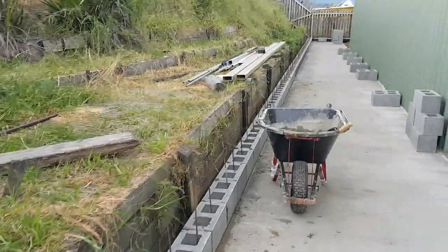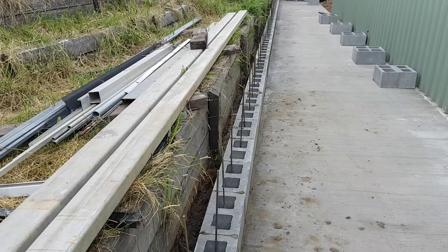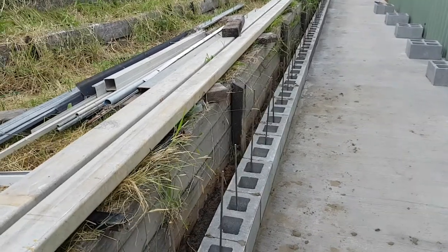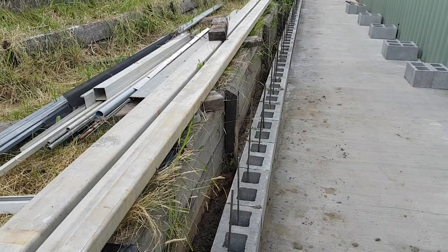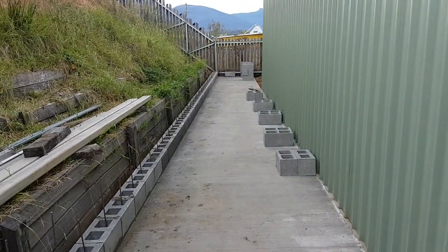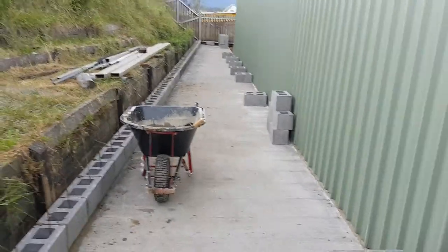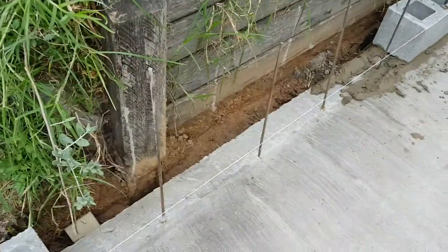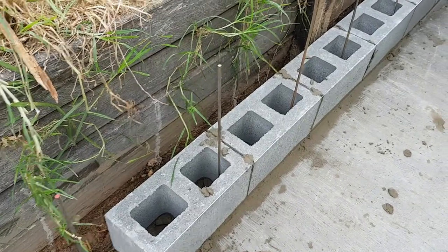When building for fluid pressure — and it really is fluid pressure we're talking about — earth won't bend back like water in a tank. You can see a little bit of failure here: the post in the centre of the picture has actually started to go upright. I originally had all the posts leaning into the hill. This area suffered a lot more pressure than other areas and the footing for that post may well have given in a little bit.